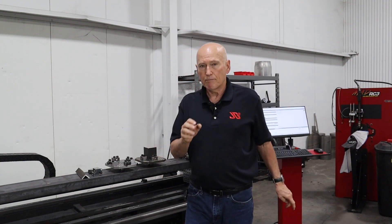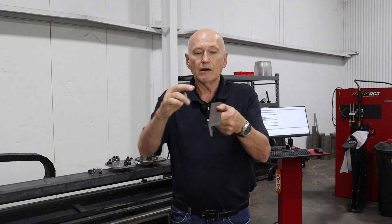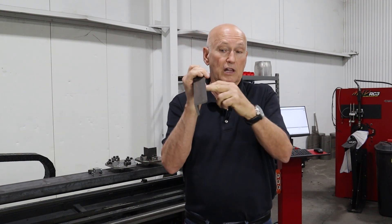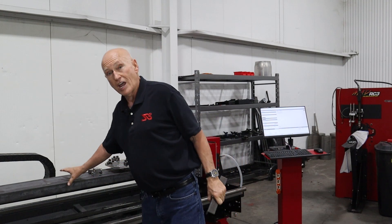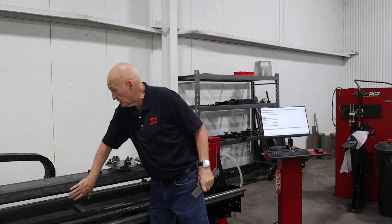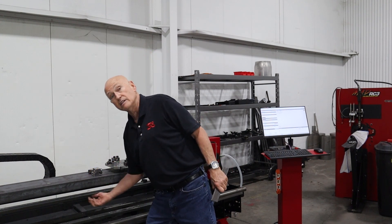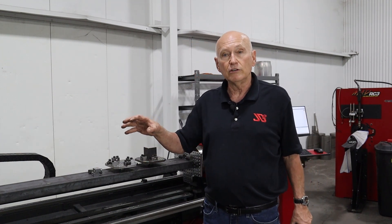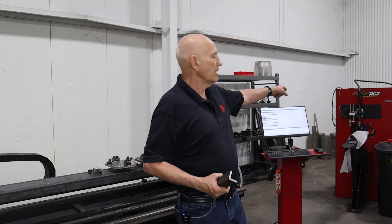That brings up a good point. If we're referencing off certain items, we're going to reference off the outside of the workpiece and clamp on the inside. However, depending on the job, you may have to reference off the inside of the workpiece, such as channel. We're not going to reference off the edge or the top — we're actually going to reference off one flange and the underside, the inside of the web. I'll explain that in the next videos. That's why I love these traveling head machines, because we're allowed to do that.